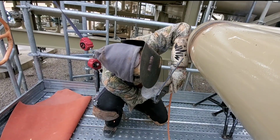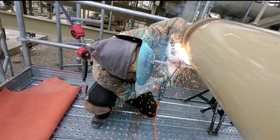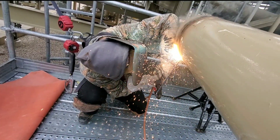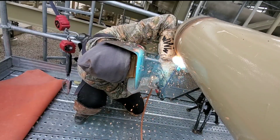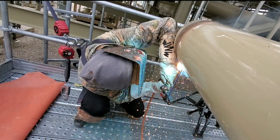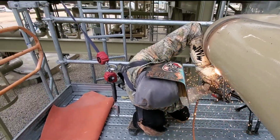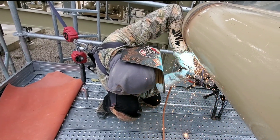One of my favorite things to do is weld — if you haven't learned that yet, pay attention. I love the bead, I love the hot pass, I love to fill it, I love the cap, I love to weld. You always have to be tied off when you're in the scaffolding — it's just part of the rules. If you're not following the rules the consequences could mean you may no longer be there. Pay attention, follow the rules at all times, and again and again stay inside the bevels. That is called the arc zone and it is important to stay inside the arc zone. If you arc outside the pipe you're scarring the pipe and therefore it makes it weak in that spot.